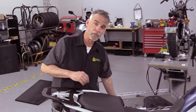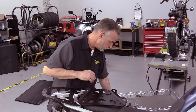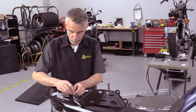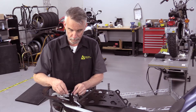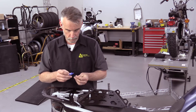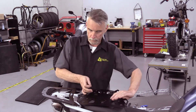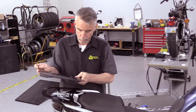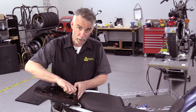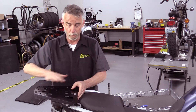That's our intermediate rack. Next step is going to be to fit the top rack. Remember those little spacers with the countersink? They come back in here. It gets a little interesting — you're going to have to do a little bit of juggling. It's easier if you start the front one. Add a little bit of Loctite, center it right at the front, drop it in and just get a little bit of thread going. You want access to the rest but you want to keep the plate from moving around.